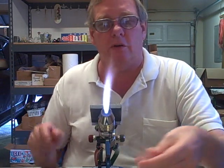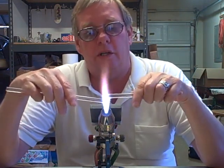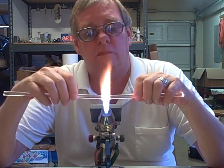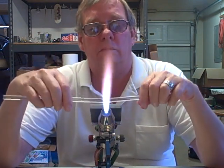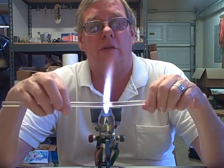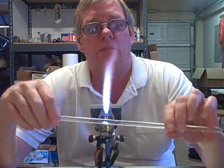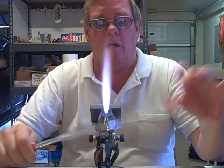When you end up with rods that are fairly short, just join them together. Just like we were talking about a while ago. We'll just heat enough glass to make the join. And I'm rotating these in the fire. Join, pull, and then rotate. I'm going to reheat that just a little bit. Get it nice and smooth. But then keep rotating while it sets up, and you'll end up with a true rod. Okay, one piece. And that's just true as an arrow.